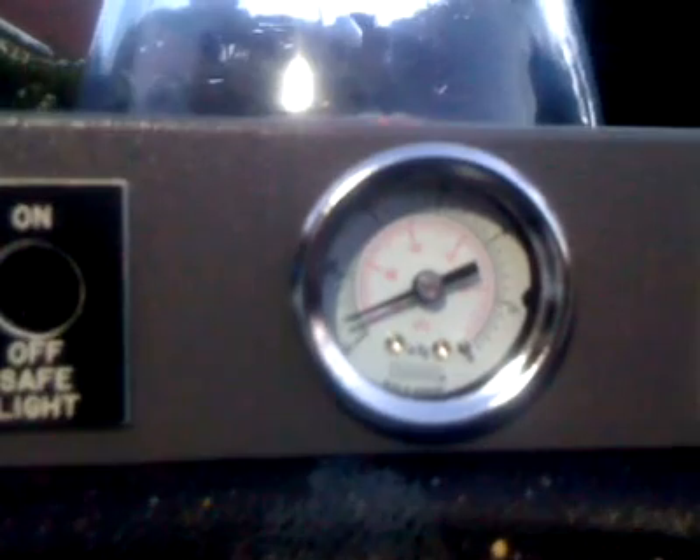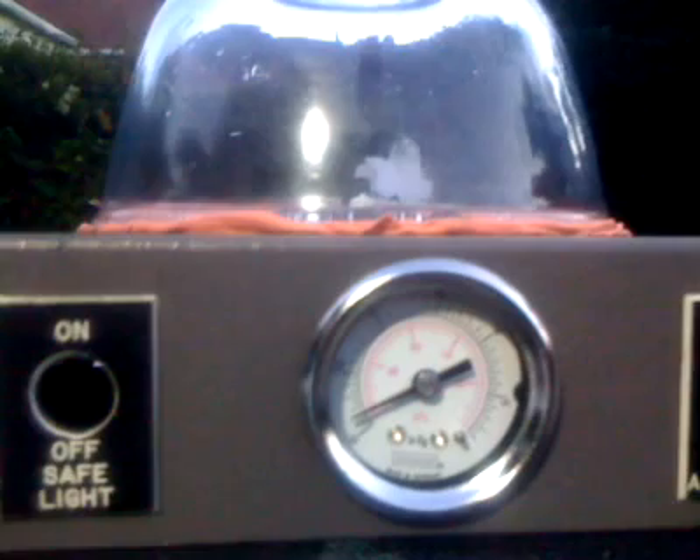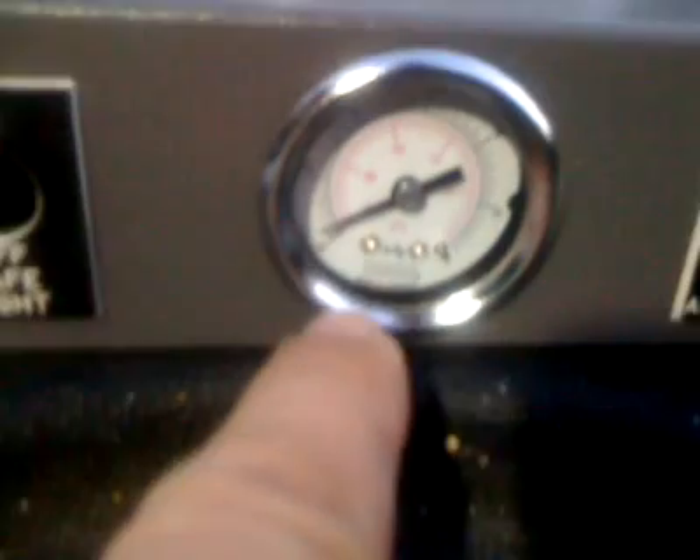From what I'm reading, 29.97 inches mercury is a complete vacuum, but from here on in it takes an awful lot of energy to get it to go the whole hog — you need very expensive, clever pumps to do it. So if I take a look in here now, there are some little bubbles just along the edge of the water that I dropped in there. That's not bubbles from air leaking in because we're still holding a vacuum — those are bubbles because it's actually bubbling. The ambient temperature is probably about 15 degrees, so that's pretty impressive. I dare say if I added a little bit of heat underneath the metal plate here it would boil very easily, possibly even just off the heat of my hand. Super, super simple.